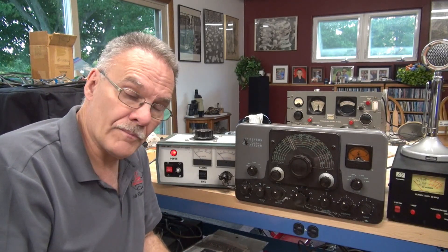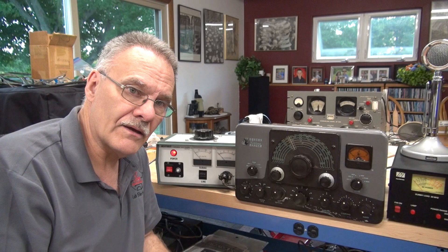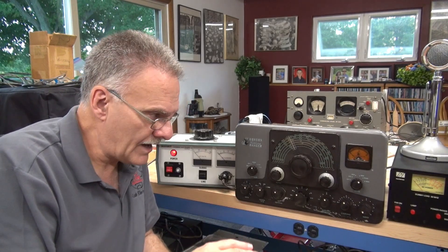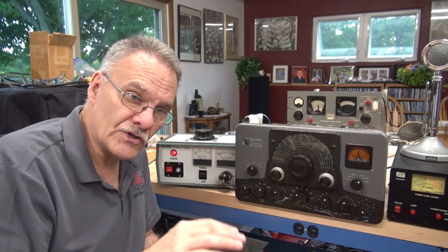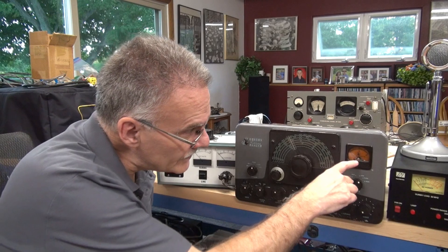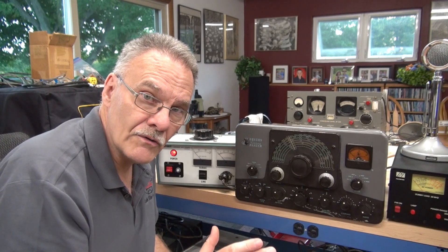Right off the bat, the power cord needed to be replaced. Also the rear SO239 jack was broken, so I had to replace that. The dual filter cap underneath that supplies negative bias to the modulator section is critical to replace, so I changed that plus the main high voltage capacitor. I also reseated the glass in the meter — it was pushed back, and if I ran it that way it could have damaged the meter movement.